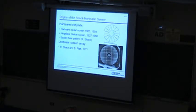And from that, they were able to predict back what the aberrations of that lens must have been. And then they went back to the optician who, by hand, ground out those aberrations. There used to be opticians who were really good at that, and I think it's a kind of dying art these days. But they were able to measure it afterwards and show that he improved the performance. In fact, it went from being a non-useful instrument to being a very useful instrument.